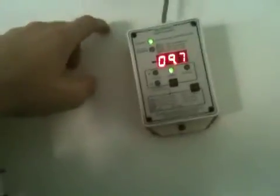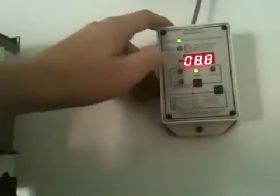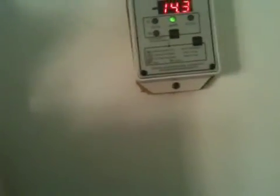These meters also have three settings: L1, L2, and L3. L1 is the easiest with just a couple of changeable parameters. L2 is more extensive with extra options. L3 gives you a lot of extra data and history over a long period of time. This is useful if the system is set up for a friend having issues — you can look at the history and determine, for example, that they've been over-discharging their batteries every day and need to make a change.